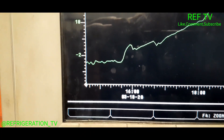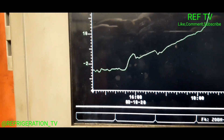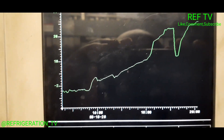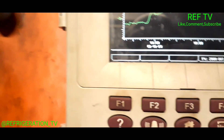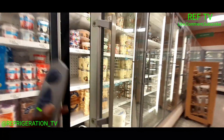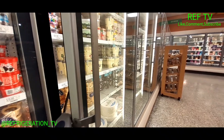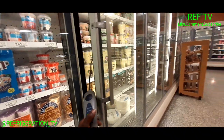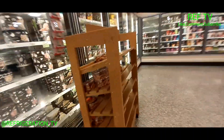Let's see how long it's been running hot. 1600 today — that is 4 o'clock. This thing just started spiking. I just made the call for some gas, got refrigerant on the way. Here's our ice cream case that we're actually here for — it's running warm. Stick my leak detector in there, so far it's not picking up anything.